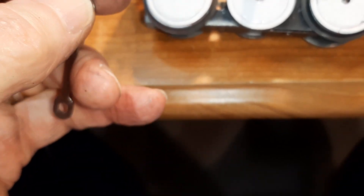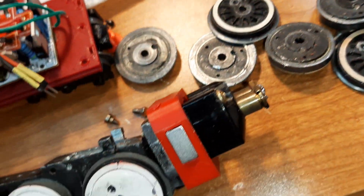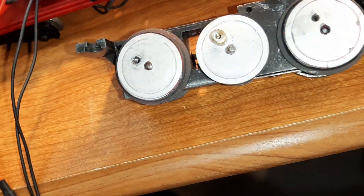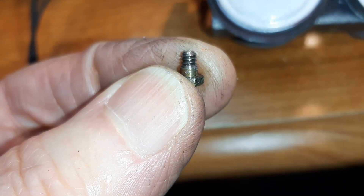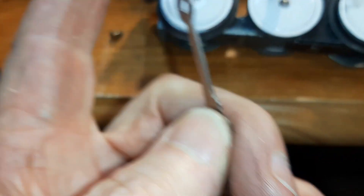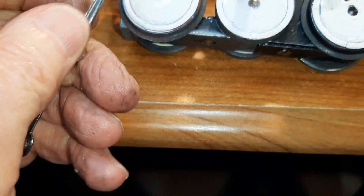What I'm trying to figure out is a way to set this aside. I tried a washer behind it, but that was too thick for the shoulder screws we use to mount these linkages. The shoulder has a limited throw to it and you can't just increase it. So now I'm looking at just making this as smooth as I can by buffing that edge down, rounding it off, and making it flat. Maybe even giving it a little bow in the middle so it reaches over away, resting only on the outer edge and behind there. If it rubs behind there, you don't really see it.